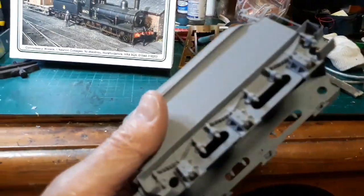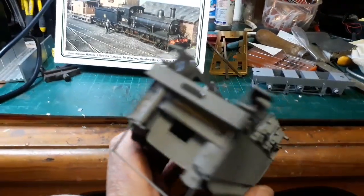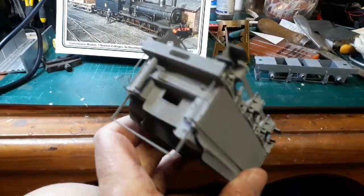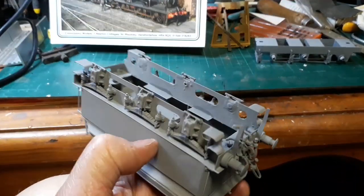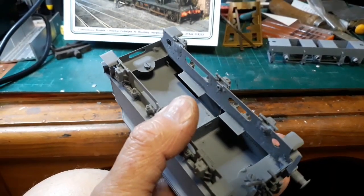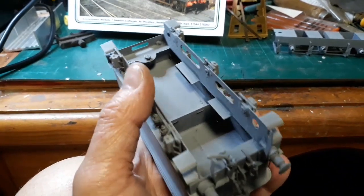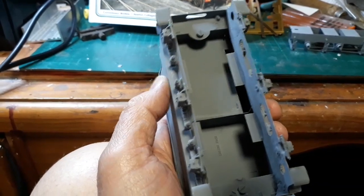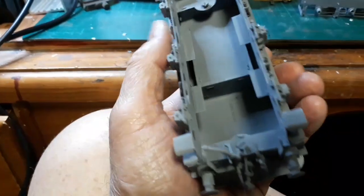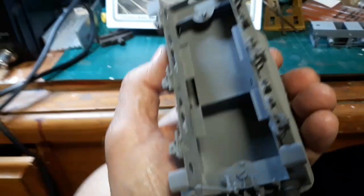What I've done now, I've spent 3 or 4 hours cleaning it all up, scraping stuff off everywhere. Then I gave it a good clean. First of all, I used some washing up liquid, but I put baking soda in it — baking powder, I think it's called — which is an alkaline product. I wanted to get the grease off, which is why I used some washing up liquid. With the baking powder being alkaline, it neutralizes the flux from the acidic flux.